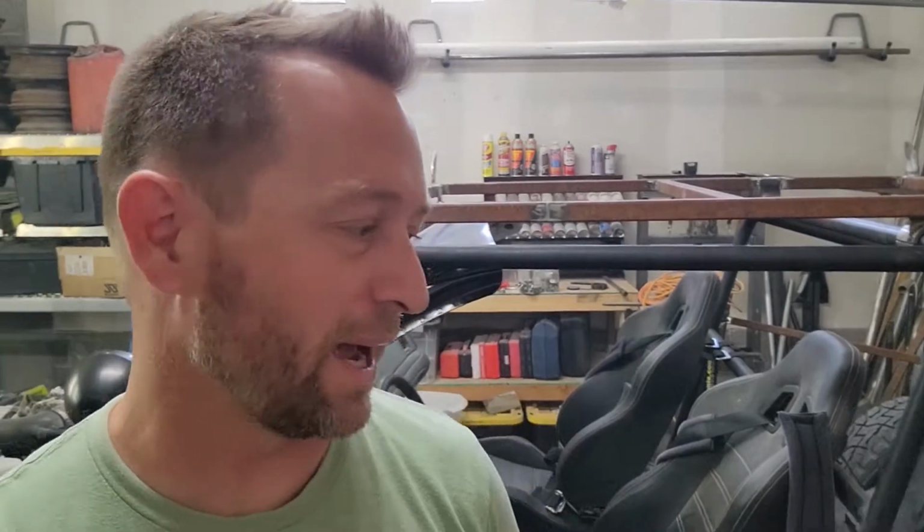After I get off work, we'll go out and cut the roof off of that van, and then we'll get it back here, cut it into two pieces, and then I'm trying to decide if I want to weld or self-tapper the sheets on. Welding would be stronger, but if I ever needed to get that off because it was a completely terrible idea, that would be really difficult if I weld the whole thing. So that's the next plan. Junkyard this afternoon, and then we'll get that deck put on as soon as we get the two sheets.